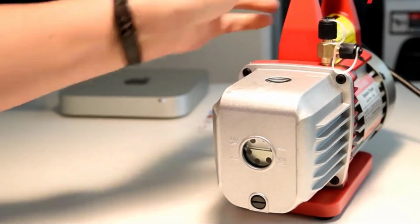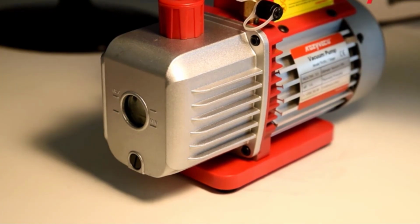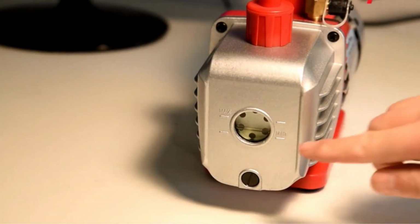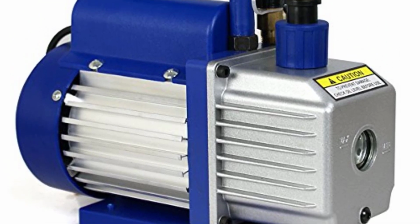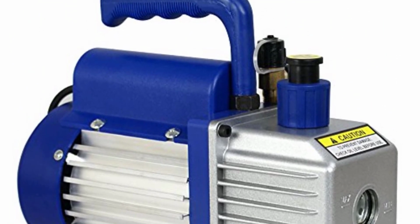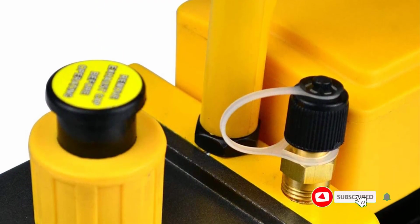If you are working with HVAC systems and have recovered the refrigerant, you will want to have a vacuum pump handy. These will help remove any unwanted water vapor or air left in the system after the recovery has been completed. This is the best way to ensure that any refrigerant left behind can be used later, especially if you are using it on the same system.